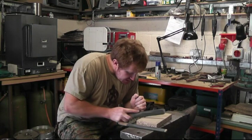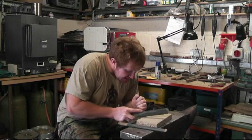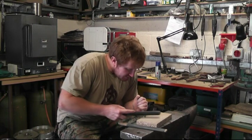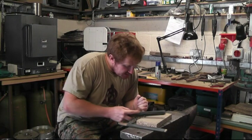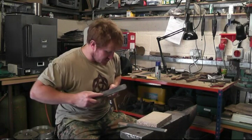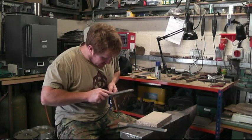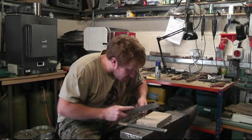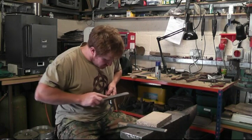The advantage of using the leather as opposed to the sandpaper for trying to remove that last little piece of burr is because the leather is soft, it gives ever so slightly and will leave us with a very, very slightly rounded cutting edge. This almost sounds as if it's going to be a disadvantage, but that slightly rounded edge means that the cutting edge will actually last longer in use, it will reinforce it. So we'll just touch that outside, you can see how I keep flipping it from one side to the other, getting much more gentle with each stroke, so I'm almost just wiping that residual burr off.